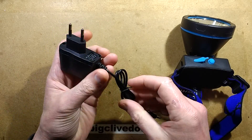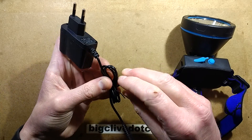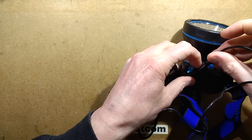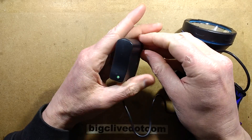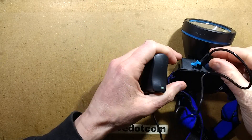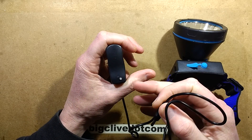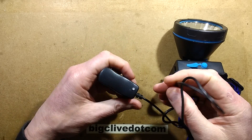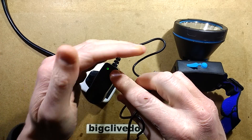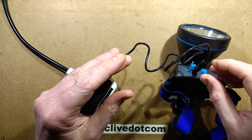It's notable that this is a very common type of charger that comes with these. It's the kind where when you plug it in, the green LED in the charger lights immediately — because the green LED is just lit all the time. It's a super basic design. It's supposed to go from red to green when fully charged and red while charging, but in reality the green is lit all the time and it's only when the red turns off that you can see the green. It's a very simple circuit.